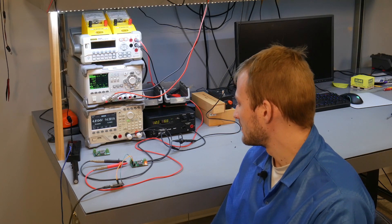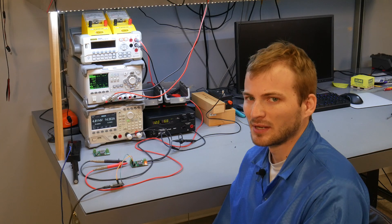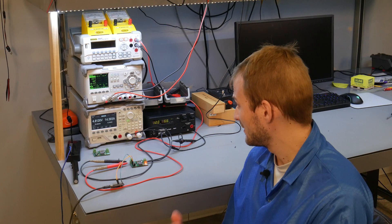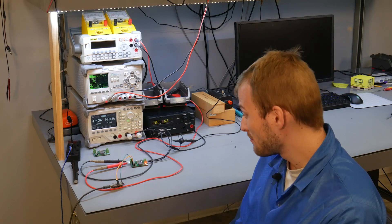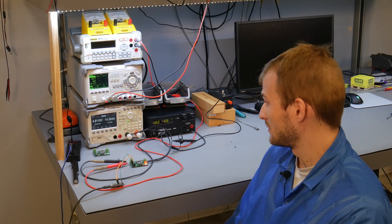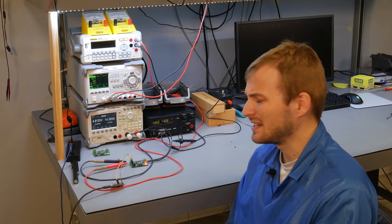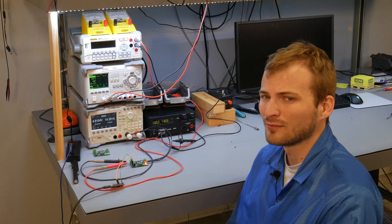The first IC for this video is based around the SIC45 buck converter, and it takes a lot to get me excited about a buck converter. But this absolutely does it. Right now this tiny board on one-ounce copper is sourcing just about 15 amps at 5 volts, being supplied at a nominal 12 volts at 6.6 amps — about 85–90% efficiency — and the junction temperature is around 80°C, which is almost half of what it's rated for.